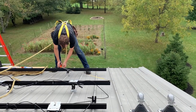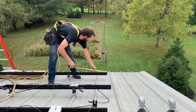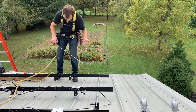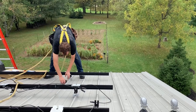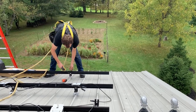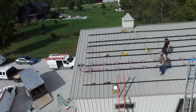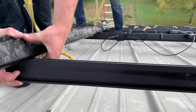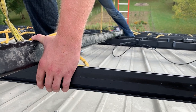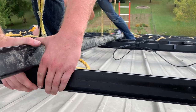At this point we're going to use triangulation to square the rails. Triangulation is a foolproof method — if you execute it with caution, you will have two identical right triangles and your rail ends will be perfectly square. You can measure from the edge of the roof or use a visual reference point, but sometimes those are not reliable, so it's probably best to triangulate and then also reference. We're utilizing an accessory rail to level the rails on the rooftop. Level rails and square rails all contribute to an aesthetically pleasing finished product — I highly recommend both steps for any professional project.